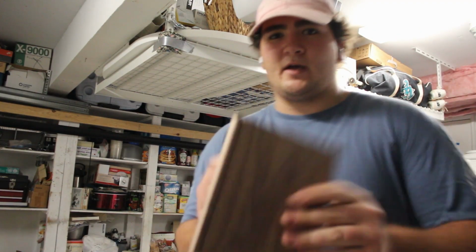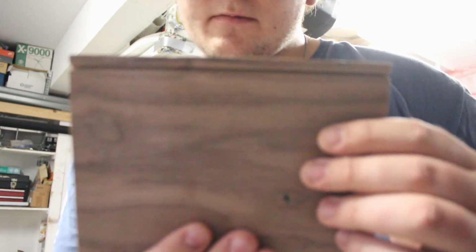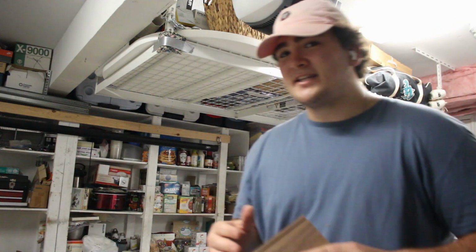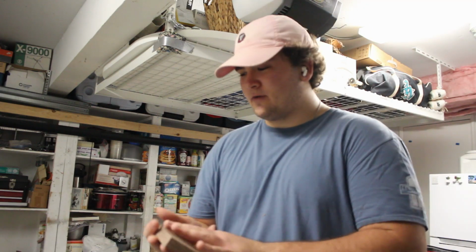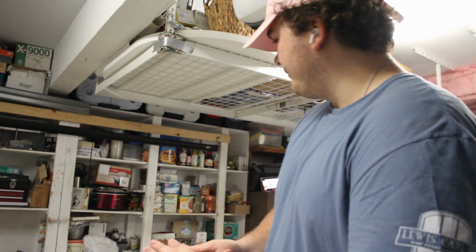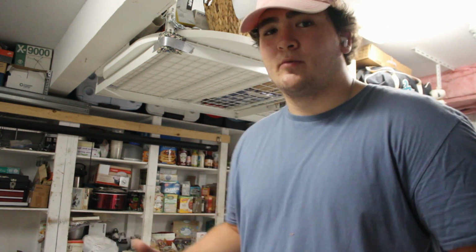So that was the first pass, and as you can see, it looks like this right now. Kind of hard to see. This camera's focusing too badly, but you get the idea. There's a slot. So I only moved it over a 1/16 of an inch, because that panel is only about 2 blades width. That's what it looks like. I'm going to give one more pass and see if it's snug. If not, we'll do one more pass after that.